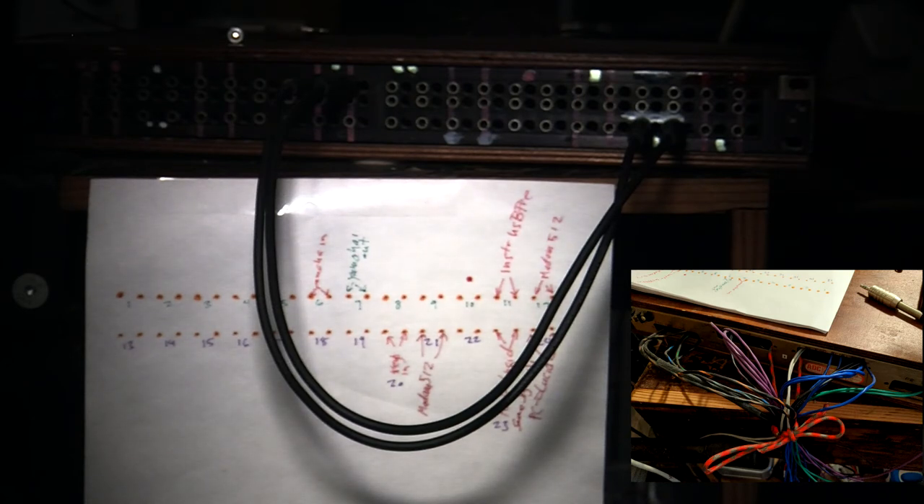The connector you're looking for is XLR. You want to figure out how to connect a three-pin XLR to TRS. When wiring inside the patch bay, you've got to be consistent — however you do it, be very consistent. Having a multimeter to test continuity after soldering is good, so you don't have any shorts and everything's working like it should.